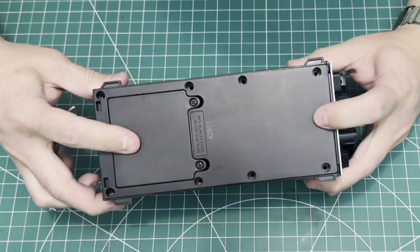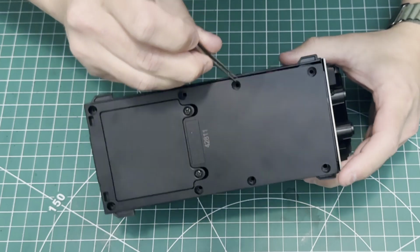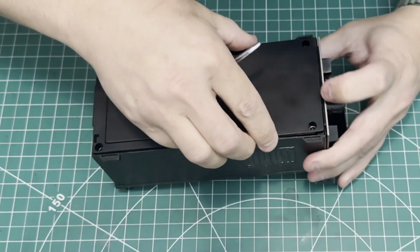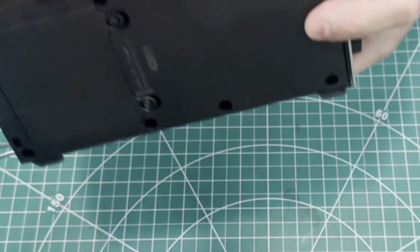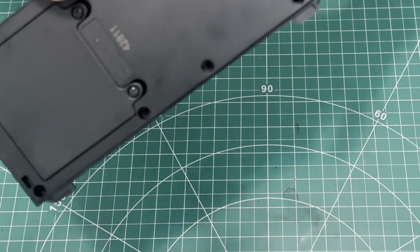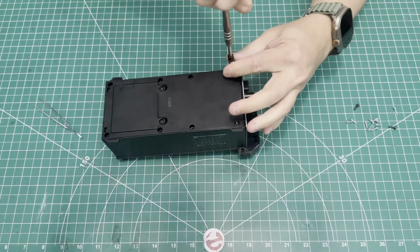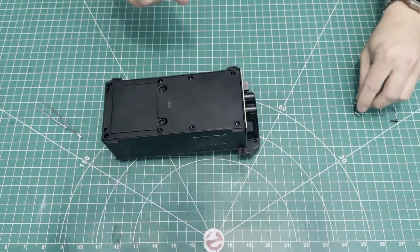You need to wiggle it a little bit, crack it back open. You can use your tweezers to pull it out slightly. Take a look, do a little peekaboo, and push the wires down with your tweezers if anything is binding. You do not want to cut your wires by screwing a screw in over them or pinching it between various plates and sandwiching them. That would be bad.